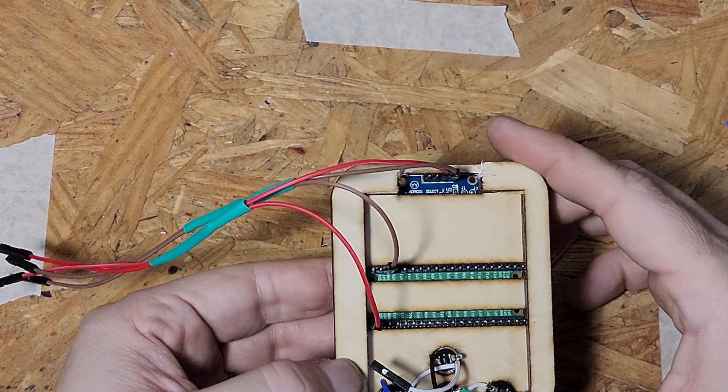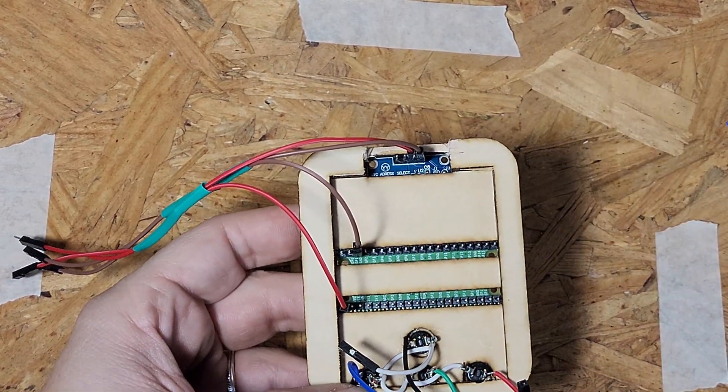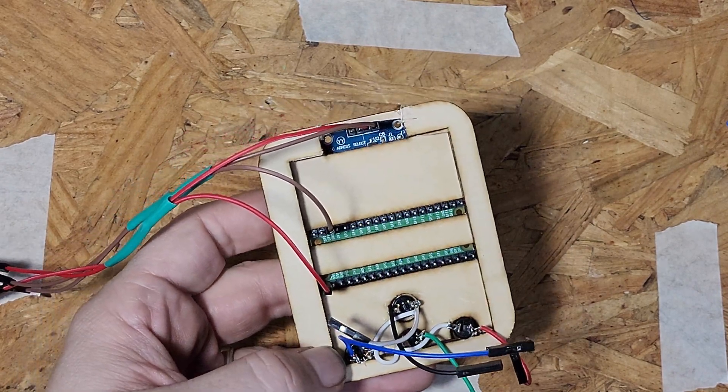This build is not only to solve this problem, but perhaps illustrate an approach that might not have been obvious before. I'm going to need two of these wires to serve as power distribution from the circuit box to the control box for the microcontrollers, so that leaves me with two wires to serve my communications needs. There are many ways to go about this, but for my purposes I've decided to use UART — a serial technology for asynchronous communications developed in the 1960s by a man named Gordon Bell. It has been improved a bit since then, but the overall functionality has remained the same because it's a simple, effective, and reliable method. I'll save the historical and under-the-hood analysis of UART for another video; for this build I'll just focus on the things important to make it work.